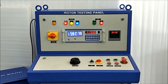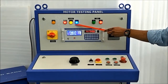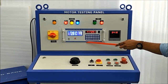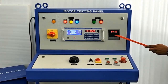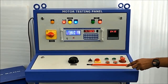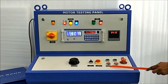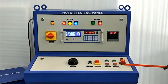Now, we can see the motor testing panel components. First: emergency indication lamp, RYB indication lamp, test on/off indication lamp, and phase changeover rotary switch for clockwise and counter-clockwise direction of the motor. The 3-phase precision power analyzer model VPA 60080M, temperature indicator for temperature rise test, and excitation unit for excitation of the dynamometer. E-volt on switch, changeover rotary switch for single phase DOL and star-delta motor, increment and decrement push buttons to increase and decrease voltage of the variac, and emergency stop push button for any emergency or accidental situation.